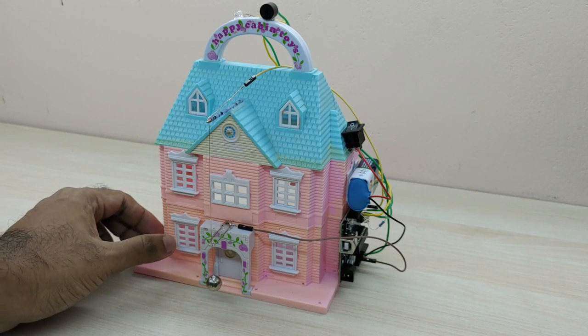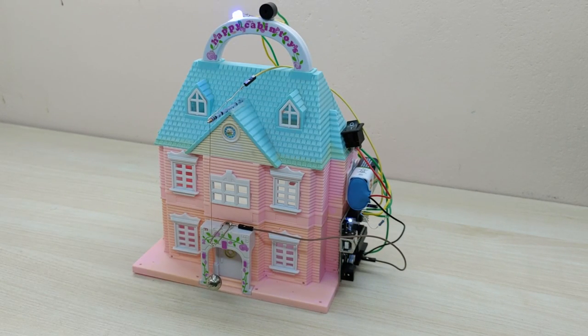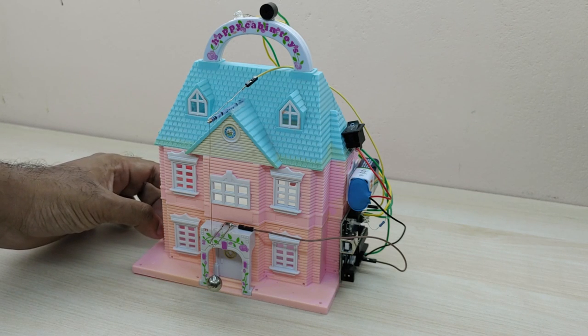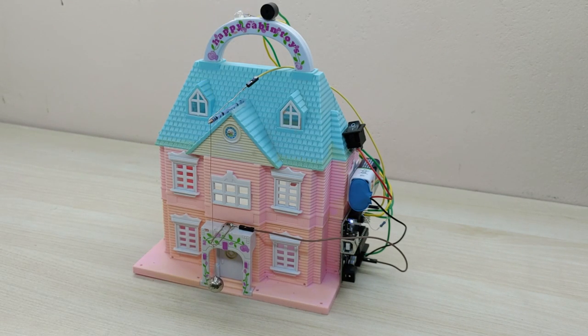It is time to see the working of the earthquake detector. I am shaking the house to simulate an earthquake. The dead mass oscillates during an earthquake and touches the electrical contact in the safety pin. This sends a plus 5-volt trigger to the Arduino and causes the alarm and LED bulb to turn on. The alarm will continue till the oscillation of the dead mass stops and the trigger is removed.